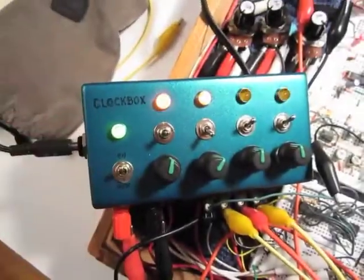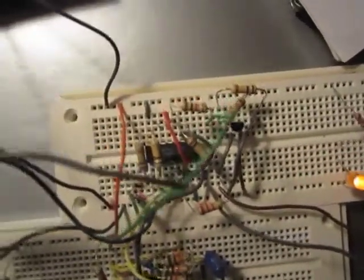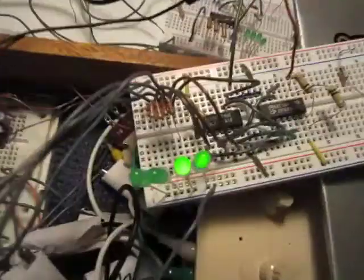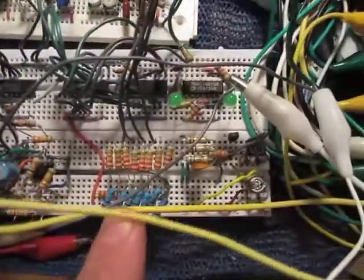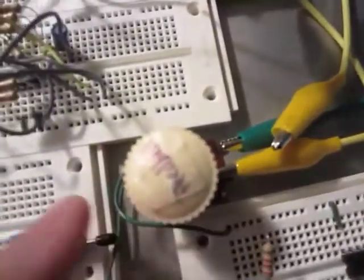Here's the clock box kicking it all off. This is the CD4023 Pulse Width Modulator Oscillator. It takes two clocks. And over here, we have the 4-bit pseudo-random generator, which feeds an R2R DAC, which goes into this home-rolled opto-isolator. That LED shows what's happening inside.